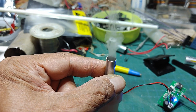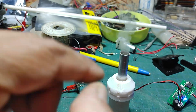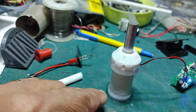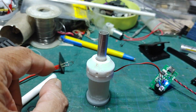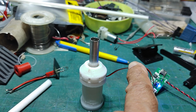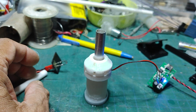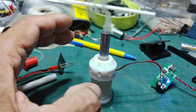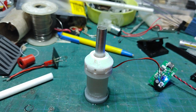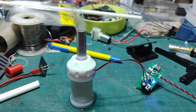I mean, look how much smoke it is, and I'm actually putting a little pressure here so that the piezo element, which is in a rubber ring, makes more contact with the filter element, which is soaking up the water from this little tank reservoir. So I'm going to redesign this with an entry point for adding more water direct from the cover of the locomotive, and that way we don't have to uncover the cover and fill this little tank, so it'll be more direct. So I'm going to do that, and in my next video you'll see that finished product.